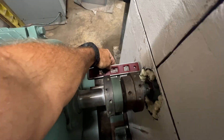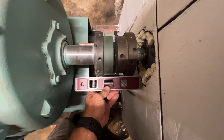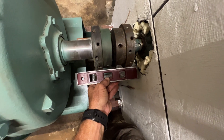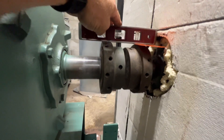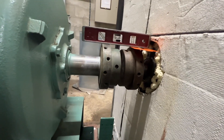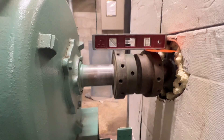Let's see how our side-to-side alignment is — maybe just a hair off, yeah, a little off side to side. Just for reference, I've got shims in the truck. Unfortunately they're not marked with the size printed on them, but basically that orange shim represents the gap difference. We'll have to take that into consideration when pulling these shims out to get it to the right height.